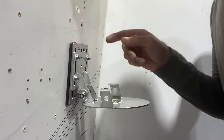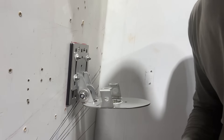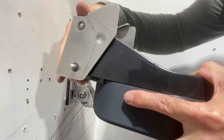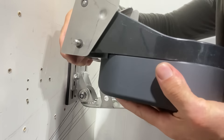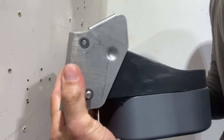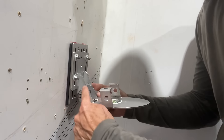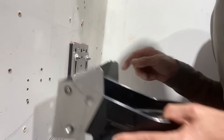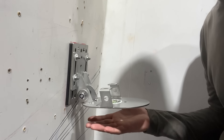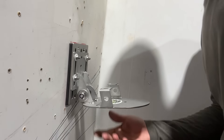So there we go — there's the TI jack plate as an addition that you can use with the original mount or the TM2 duty mount, which is rock solid. There's no vibration on that and no accidental kick-up. With the original mounts you get accidental kick-up — I've seen these brand new just pull up out of their locking mechanism at the back. They're plastic and obviously they rattle in the water too. These will sit up to 50 millimeters deeper than those. Hope you enjoy that and find it informative. Get in contact if you want any more information — we ship anywhere around the world. Thanks for watching.